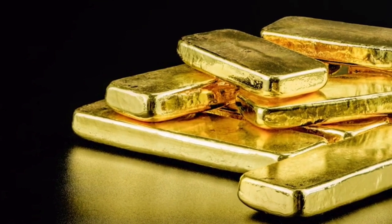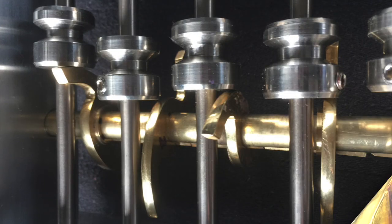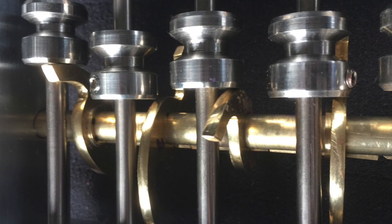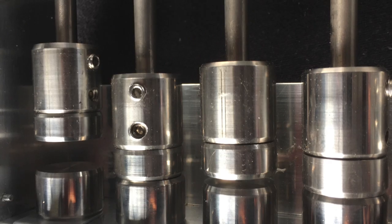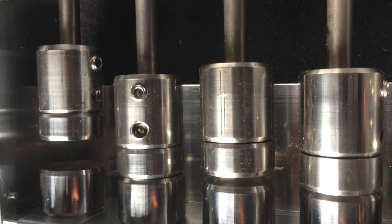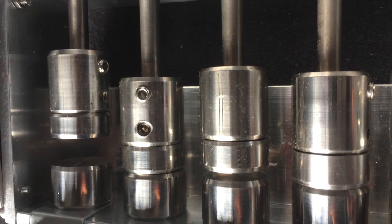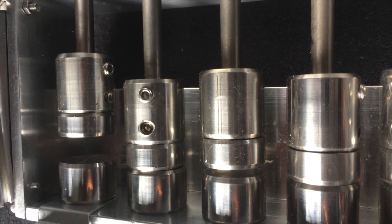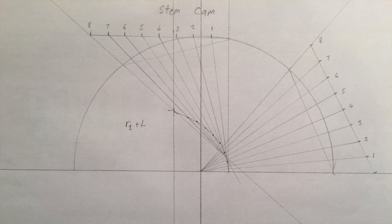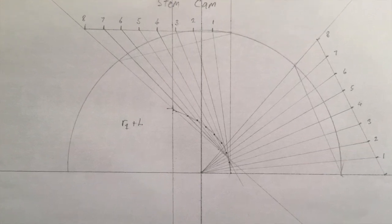The proportion of gold and silver would vary depending on the location of the mine. In this close-up of the model you can see the tappets and the cams that lift them, and below that we have the hammers with their shoes and the anvil on the bottom. The shoes and anvils would wear out in about a three-month period and therefore are made removable.